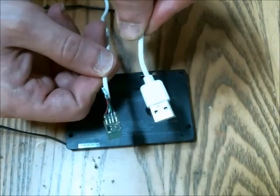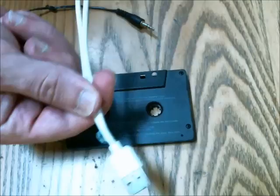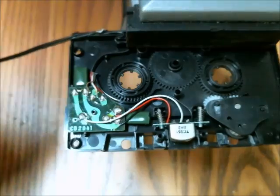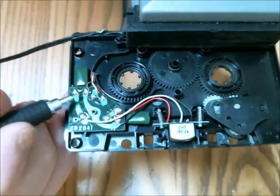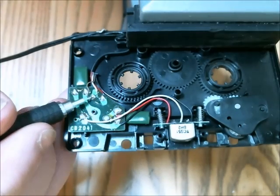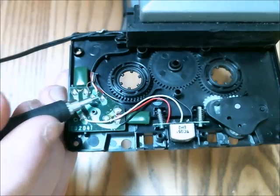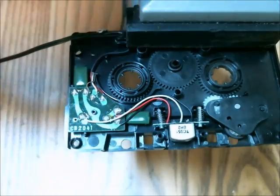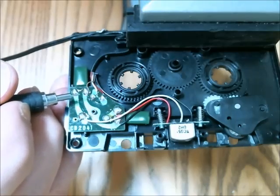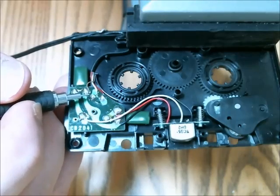I can output audio from my PC. I opened up the cassette adapter and here are the inputs that would normally connect to your cell phone. I'll need to remove those three and connect the speaker output of the Bluetooth headset to ground and to the right channel.